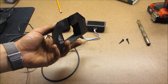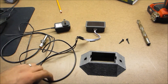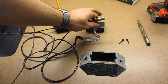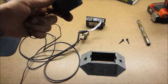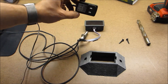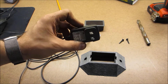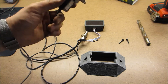I designed this plastic part over here that holds the tach in place. This is the RPM sensor — it comes with a magnet. So what you really get is the display, the sensor, and the magnet. The wiring is usually not done and you don't get a wall wart. This thing has a pretty wide range of voltages between 8 and 24 volts. This wall wart was from equipment that has long since ceased to exist, and it's a 24 volt wall wart — pretty slimline and it holds a very steady voltage.